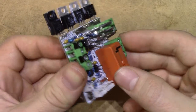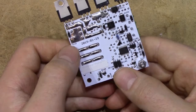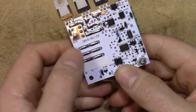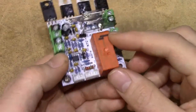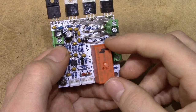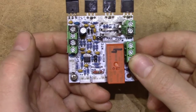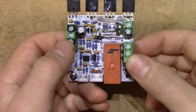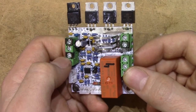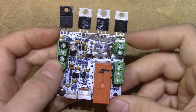The relay is 250V compatible and it's taking up a lot of board space due to the isolation required for that, although in my application I'm going to run this on the DC side. Due to that, we chose a 16 amp relay, so you can run it decently on the low-voltage side and use a 16 amp charger. You aren't limited to some 5 amp 230-volt thing, which would require a lot of 230-volt wiring inside the case, which can be unpleasant and risky.